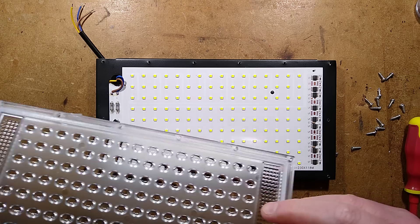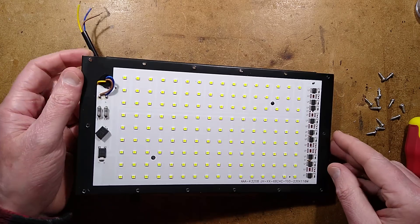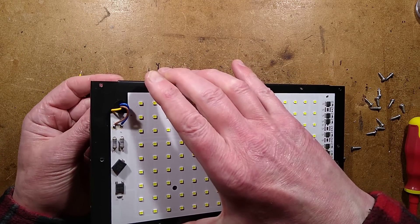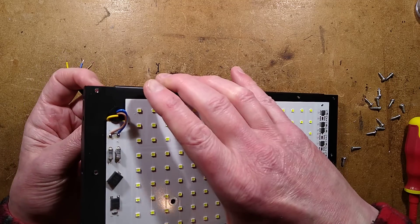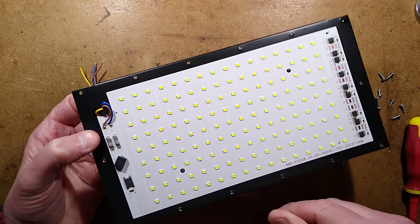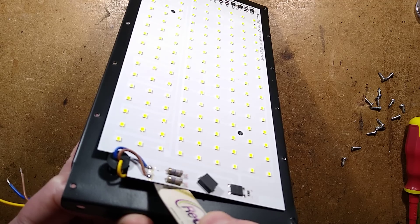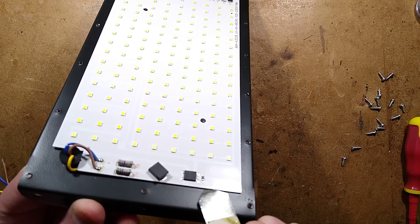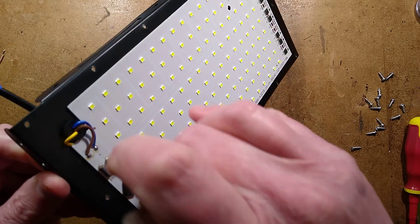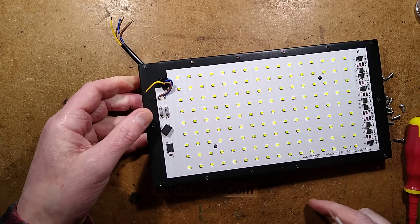I don't know how reliable that seal would be over time, particularly with pressure changes. Also, what keeps water out can keep water in. The cable here has a little grommet that is just basically poked through there, so water could get in there and also could get down the inside. The earth wire is stuffed underneath, not making a connection. Does this get heat sink compound? I would expect it to, but it's actually glued on — it might be silicone.